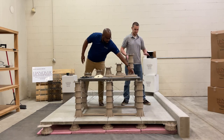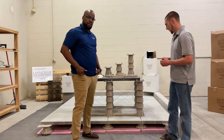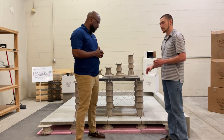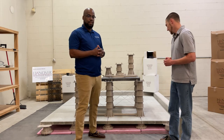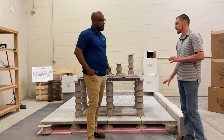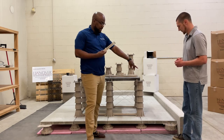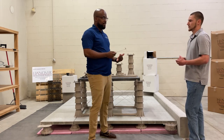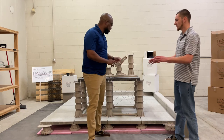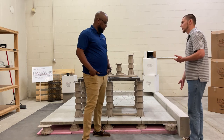Here in our example display, we're creating a level deck using nominal two-foot by two-foot pavers laid over a minimum of 60 PSI insulation in a tapered system. This tapered system has a slope of a quarter inch per one foot. At our highest point, we have two compensators and three stacked high cap pedestals, giving a minimum threshold at that point of about two and seven-eighths of an inch. We've also utilized perimeter spacers on the edge to help maintain an eighth-of-an-inch joint throughout the entire system, and the pedestal tabs maintain that spacing throughout.